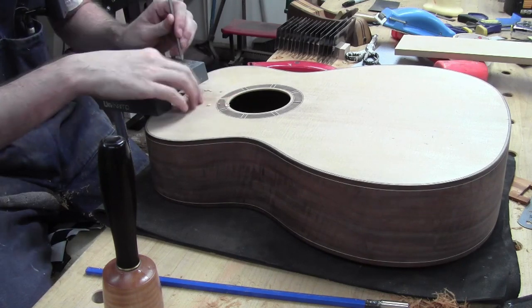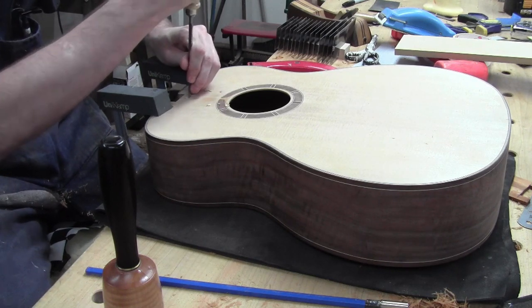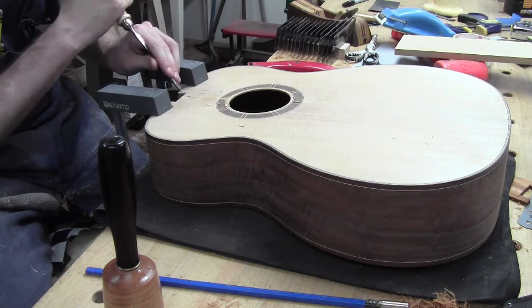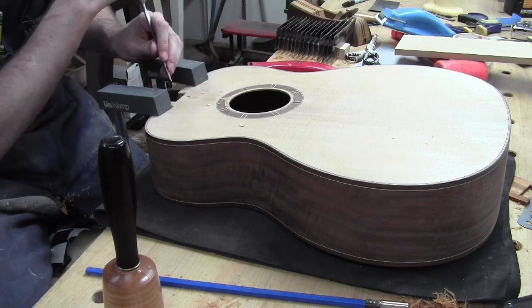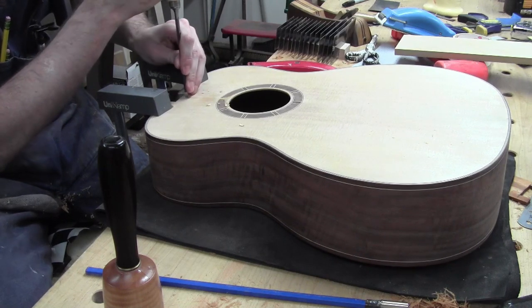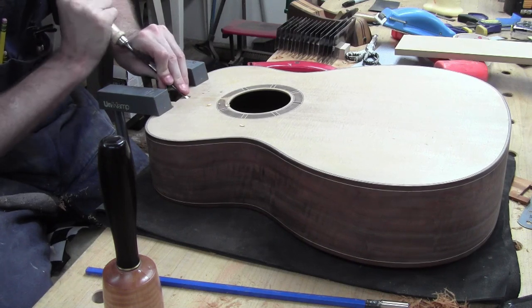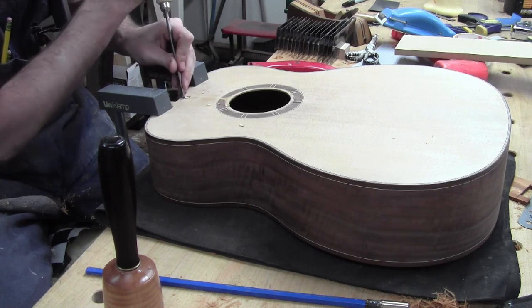Okay, let's flip some of those away. We'll come back here, and we'll pare down again. This time I just want it to cut, sever those fibers. I won't bother with the mallet here, because there's truly nothing underneath right here, so the sooner I can get away from that unsupported fibers area, the better. We are through that area, so this can just pop right out. That's good.